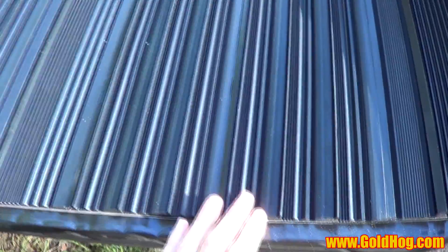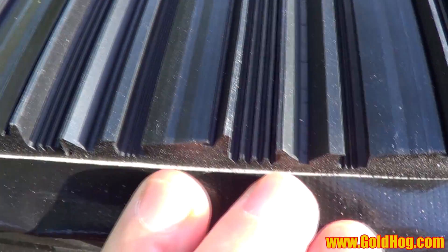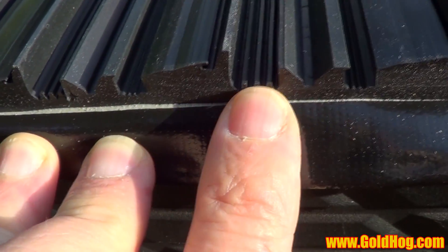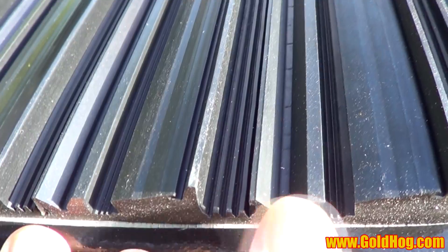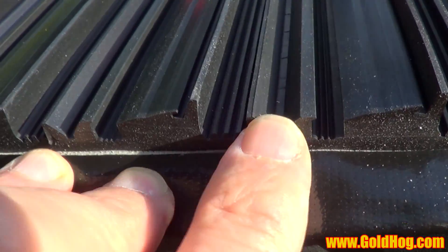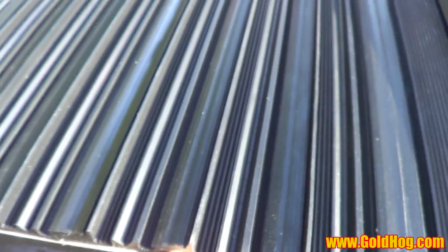Hey guys, it's Doc and we're out here. We're going to put some of this new Talon matting into one of our dredges and do a test run, a flow rate run. I wanted to show you the mat before we go down to the creek. You can see the mat here — this is the new Talon mat. This first riffle on the mat holds a lot of material. It's a real quiet zone, so it holds a lot of black sand. These two grooves right here are very active — a good pausing point for gold. It stays open, it's very violent, which is nice. Gold wants to come back into this groove, so it slows down.